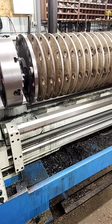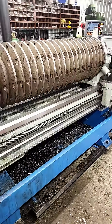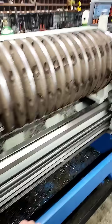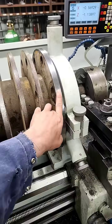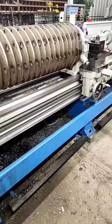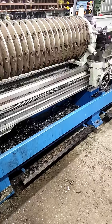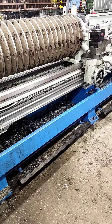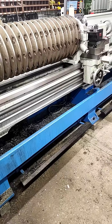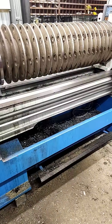So basically we started off with setting this thing up in the lathe, basically as you see it, dialing it in and cutting these reference surfaces here and here. Then, once we had those, we know we can get the rotor set back up running true in the lathe. Then we went and cut down the stub ends, roughing out to clean bare metal past the old weld repair, and welded everything up.